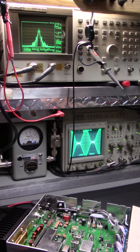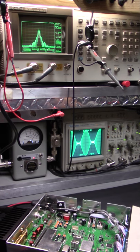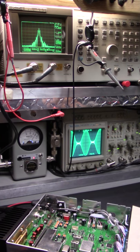The scope should look good. You really want to focus on the scope. Well, and the spectrum analyzer. I know everybody's looking at the meter. It's best to learn how to look at a scope. An analog scope, not the digital stuff. With an analog scope, I don't need to do your radio checks. I look at it to see exactly what it sounds like with my voice, not just a tone.